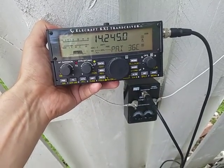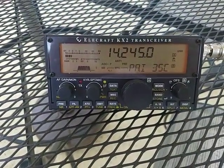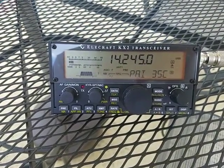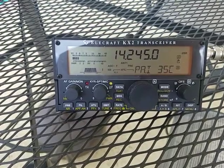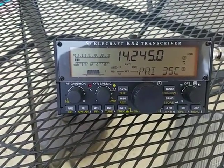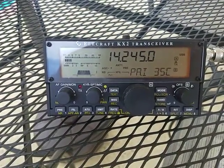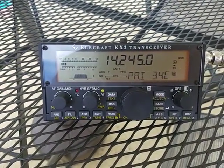I will go back to the dipole for comparison. From the MFJ loop tuner, back to the dipole — the signals from the strong station are back to pretty much 5-9. There's a noticeable difference — I would say at least two S-units, maybe even three S-units. Also, that 8-foot size may be a tad too short for 20 meters. It's very hard to find the right size, but 8 feet of wire — it's hard to know what you can get out of it.